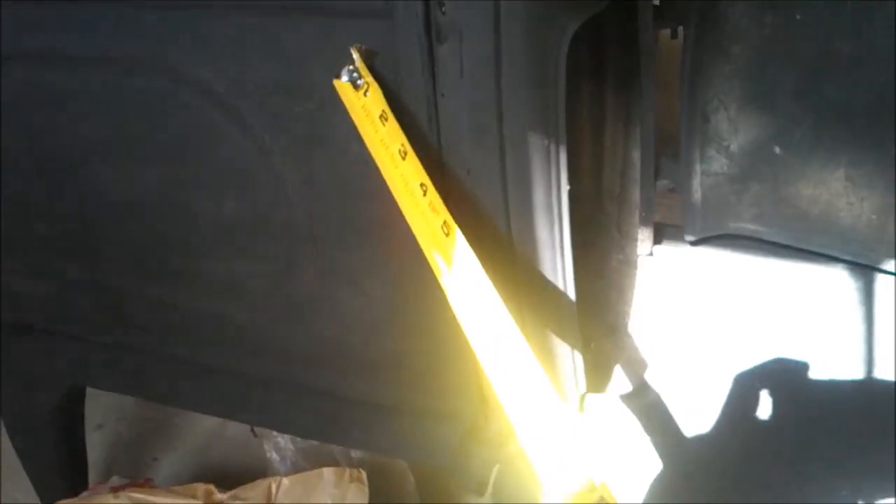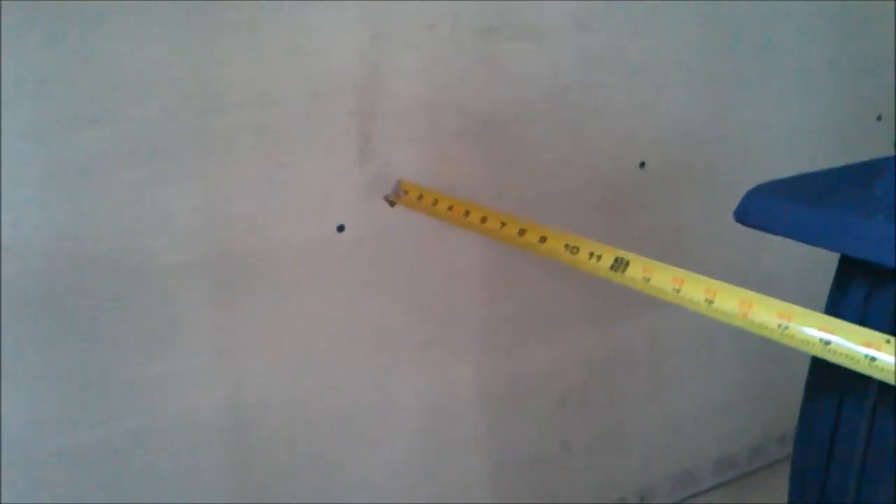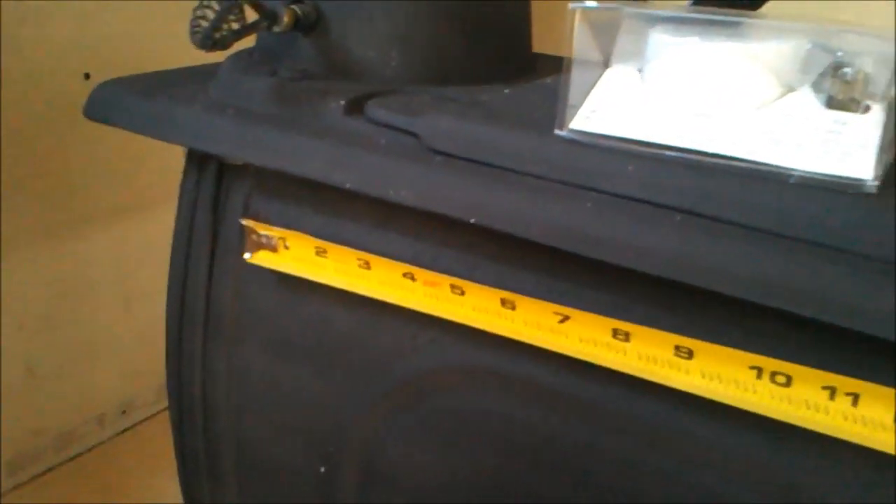What I want to do is get a measurement for my copper. I want my water jacket to come up to about right here, so I need to measure - about two to three inches off of the wall backer. I may have to trim that, but I want to get a couple of equal-length pieces. I want to go 36 inches right there - I'm going to cut two of them at 36. Then depending upon my 9 and 13/16 center to center, looks like I could do 16 inches right there, because that's meant to take a 16-inch piece of wood. Let me cut a few pieces here out of this pipe.